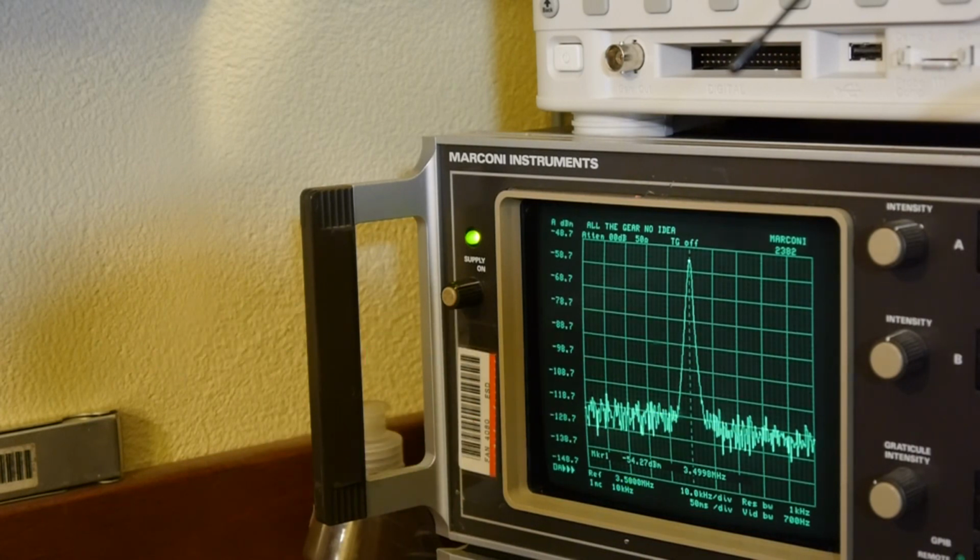So you can see that our attenuator is actually really conservative. If anything, I've probably got more attenuation than I want in this device, but it's very easy to adjust it. All you've got to do is open up the box. You can either make the area of that loop antenna a little bit bigger, that little loop wire, or alternatively, you can take the wire and bend it closer to the dummy load, and that will reduce the attenuation factor. So you've got a little bit to go at there, but it's probably better to start off conservatively.